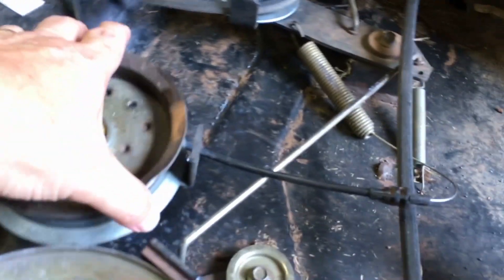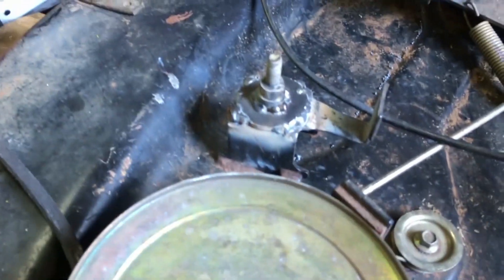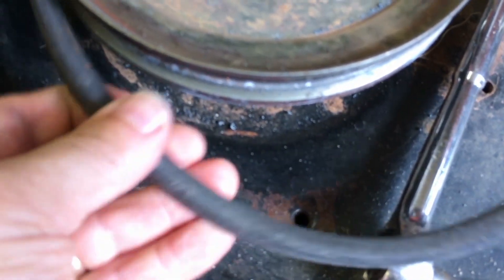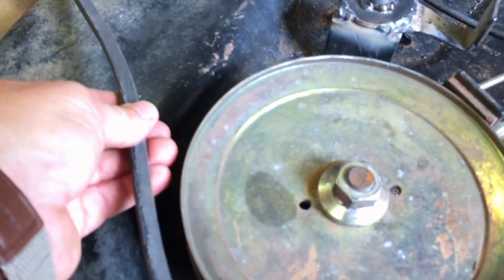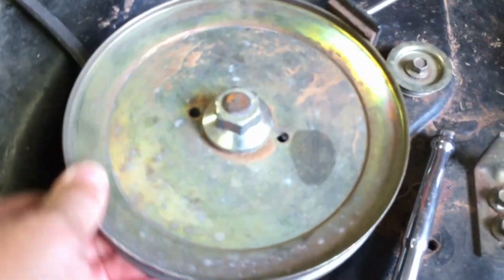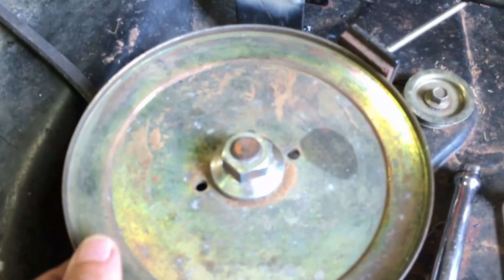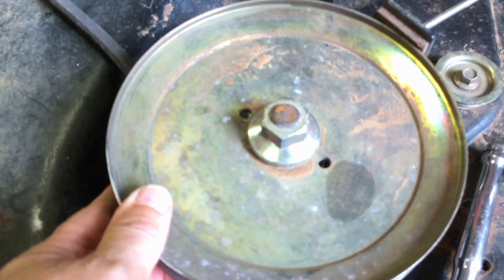That's good — maybe I won't be burning up so many belts. I mean, probably two hours of mowing time and I'd burn up a belt. Last time wasn't quite that often, but you can see that belt is pretty much chewed up — that belt is about a month old. That thing kicked to the side was really chewing that belt up and making it hot. I've got a new hub for it; this one's pretty free, it's okay. There's a new spindle over there, so I could put a new spindle on it, but I'll wait and see how this goes.